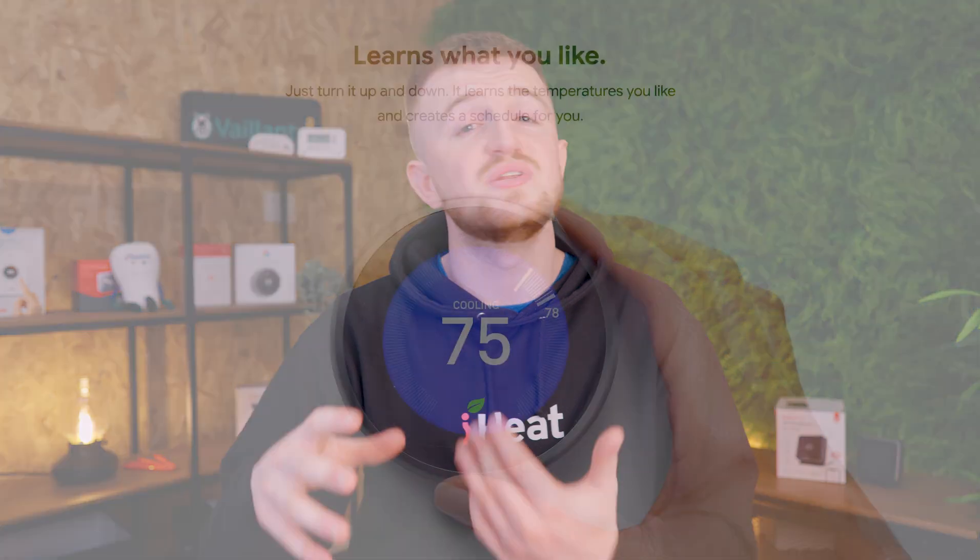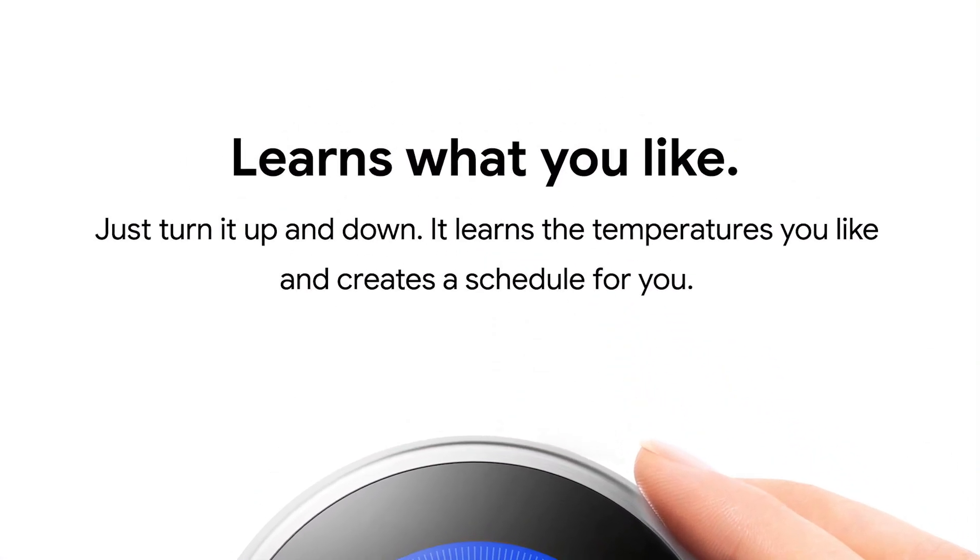You can always use manual mode so your house is always at a set temperature, but this can cost quite a bit of money. This is where the T6R's adaptive intelligent control comes in — similar to the Nest learning thermostat, it learns your habits and how long it takes your boiler to reach a certain temperature, starting the boiler earlier or later accordingly. On my old boiler, setting the timer for 7am at 21 degrees would take an hour or two to actually reach that temperature. This thermostat can track that and adjust its schedule accordingly. It could go further with AI to learn irregular patterns — like leaving the house at 3pm on a Thursday — as the Nest does, but it's still very clever.